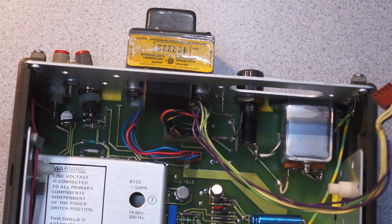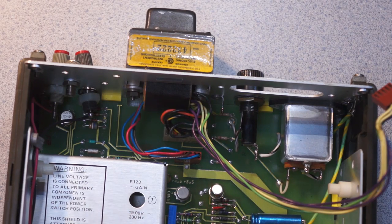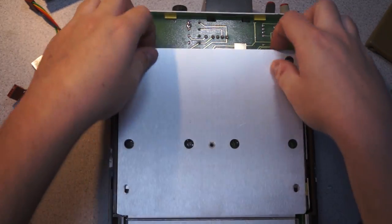I'm not too sure why they're doing that. It's an interesting approach, but it seems like the downside is that you have more power draw because you always have the magnetizing current of the transformer. I don't know what the advantage is, aside from the fact that the transformer stays warm, but I don't think that's really relevant.